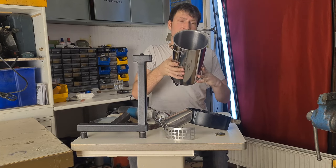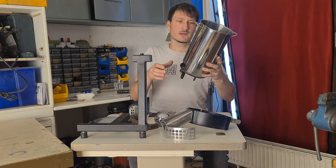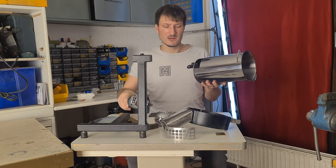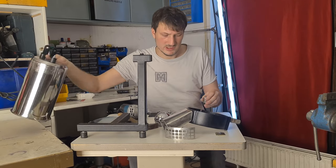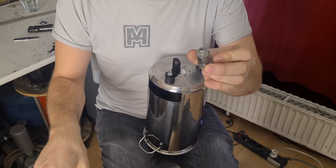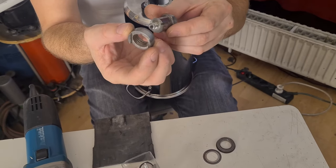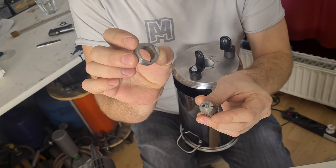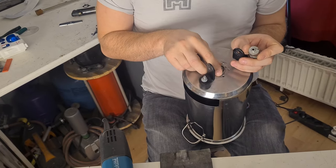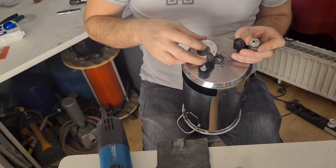The most important part to build the blender, aka shredder: we need an asparagus pot — it's tall and not so thick, and perfect for the job — and an angle grinder, that's the most important part. The little part we also need is an adapter, a polishing adapter. I turned it on the lathe, but you can also file it down. And more importantly, a flange bearing, so you can put it in here and mount the flange on. Maybe you don't need it out of aluminium.